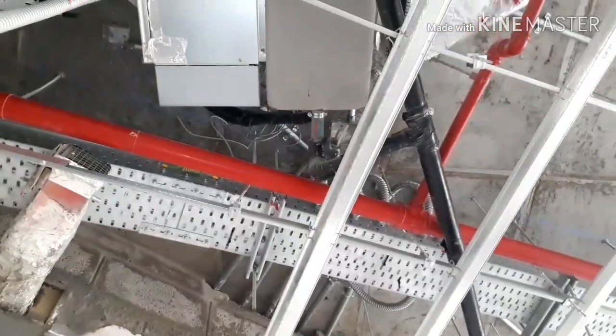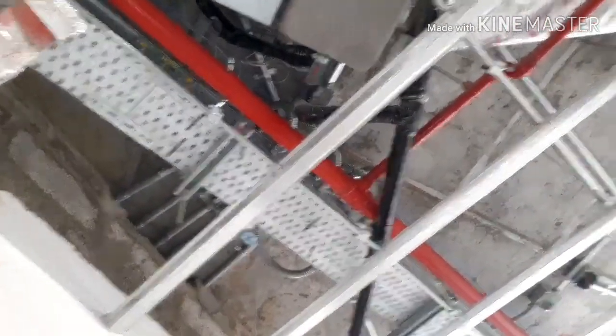Near the machine we have seen the flexible PVC hose and stainless steel metal clamp — we have tightened and wrapped the metal clamp and UPVC drain hose near the machine. The supporting rods should be spaced 1 meter to 1.5 meters. Thank you so much for watching my channel — please don't forget to subscribe.